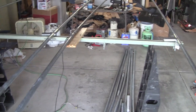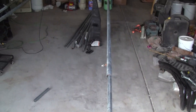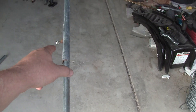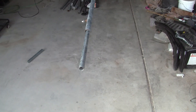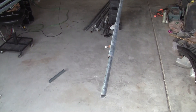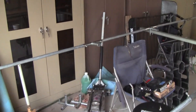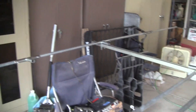The next thing I did was put in the reflector. This thing's a monster — it's really long. This is a three-quarter inch stub and that's one-inch tubing, clamped with a three-eighths coarse bolt. As soon as I put this in, the SWR went to hell — three to one on channel 1 and channel 40, which means the antenna is not resonant at all. So I finished it and put the front-most director on — still SWR is total crap.